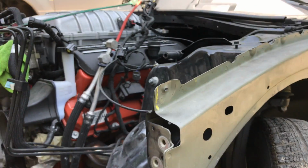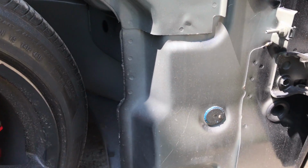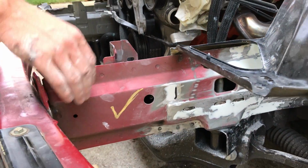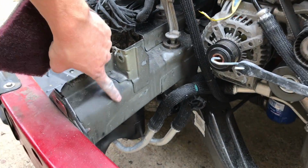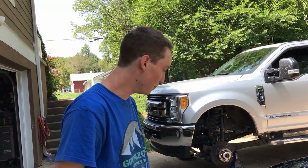And then we're gonna pretty much mist some black paint on it. As you can see here, how it's misted on there. This is all factory work here. The only black that we're gonna need to paint is just a tiny bit over here, and just kind of mist it in. And then in the front of this frame rail, because the rest of this car has this etching primer, etching primer, and then just very lightly misted on paint. You gotta make it look OEM. You gotta think like they did at the factory.